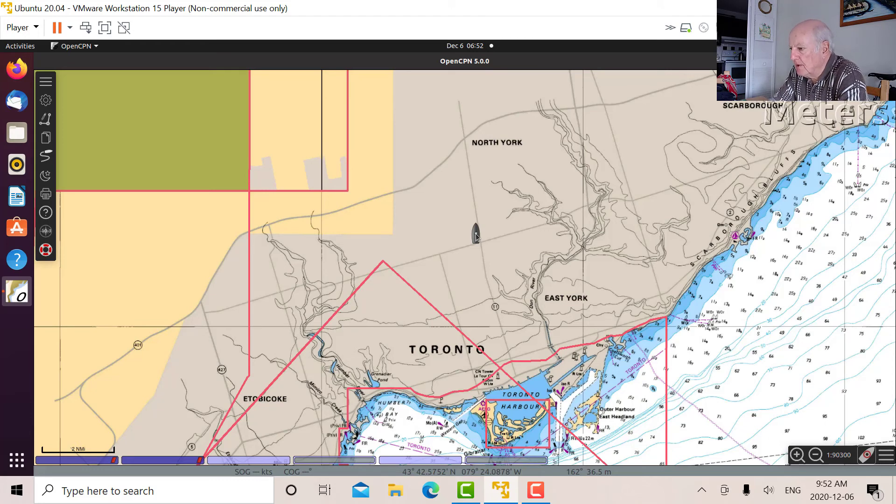In a later post, what I'm going to try to do is see if I can receive the GPS signal using the RTL-SDR. We just saw from the spectrum analyzer that the noise level was much higher than the projected received signal level. So what I'm going to do is take the patch antenna from the Lassen IQ module and connect it to the RTL-SDR. I have to go inside the box, access the receive antenna signal, and bypass the 3 volts so I don't damage the chip. We'll do that probably in the next post.